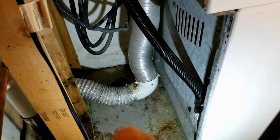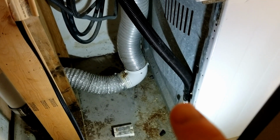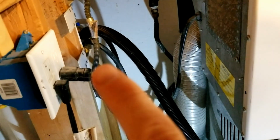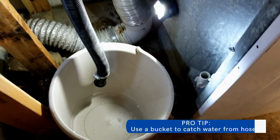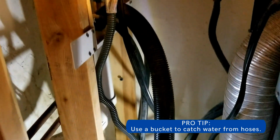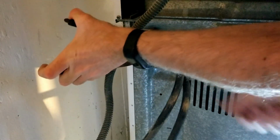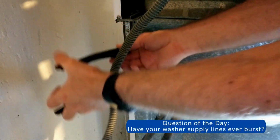Since this is a stackable unit with limited access, I'll need to disconnect the dryer vent, discharge hose, and power lines to get to the water supply lines. I'm going to use my channel lock pliers here to disconnect the supply lines at the unit. You'll want to turn the threaded end counterclockwise, lefty-loosey, to undo it.